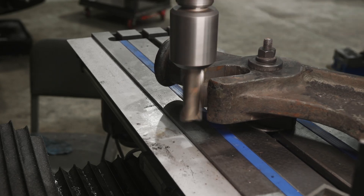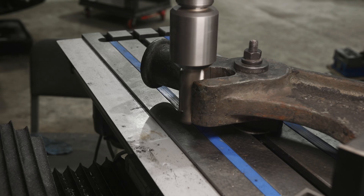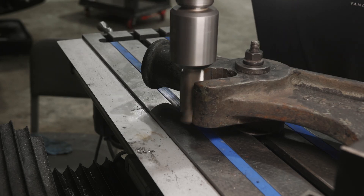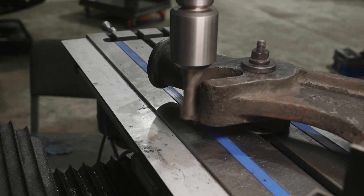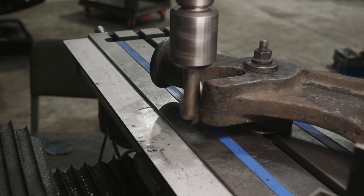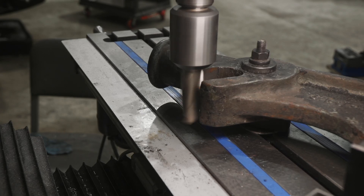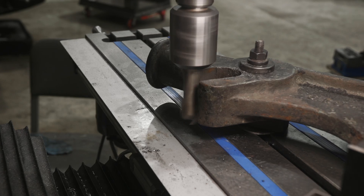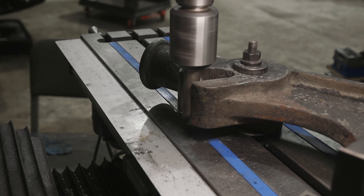Running about 500 RPMs, we're just going to come in here and touch off. Lock that axis. There's touch off — I'm going to zero. We're going to lock this axis and crank out. Taking a chip — I'm going to do ten thousandths and see how that does. I've got the gibs tight here to try to minimize backlash, and it is cast iron which is a saving grace, but I can definitely hear we're going to be getting some chatter. I'm just going to take it slow — it is a sharp cutter which is good.